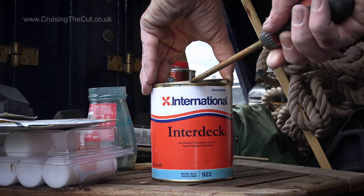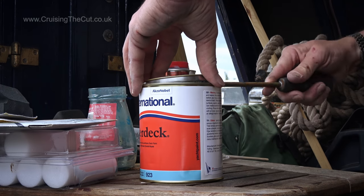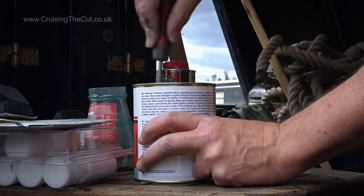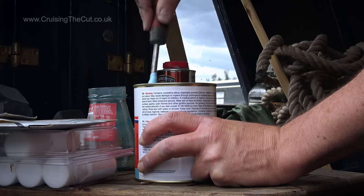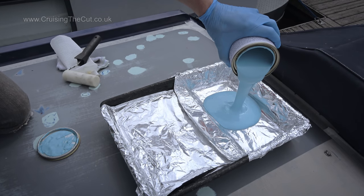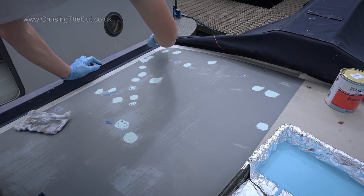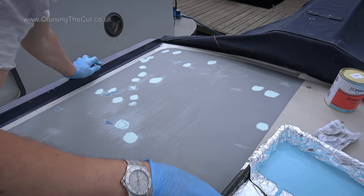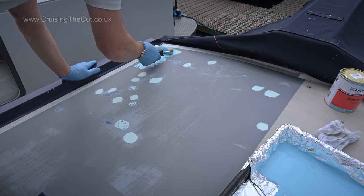You know, sometimes I think I'm amusing myself rather too much in these videos. Anyway, without a hint of phthalo blue or cadmium yellow to be seen, let alone any odourless thinners, I opened up my tin of paint. Per the instructions, and because I could see it had separated in the tin, this was given a thorough stir using, of course, a screwdriver. Then in my tray lined with foil so as not to have to wash it out afterwards, I decanted a decent load of the paint. For each section of the roof I wiped it over once more to remove any final remnants of dust and dirt, then began applying the paint. It can be brushed or rollered on, but I read that if brushed you need to stipple it to get the non-slip texture, while the roller does that just by being a roller.